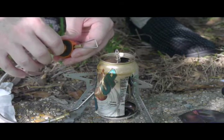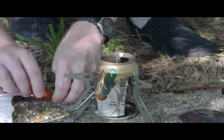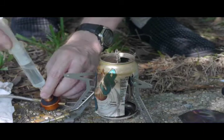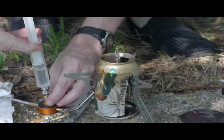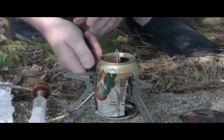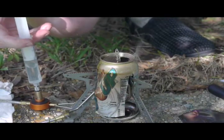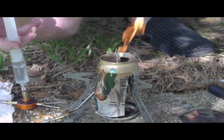You apply a light amount of force against it to seal against the O-ring, with the control valve open all the way. You just screw the syringe on — doesn't have to be very tight. I'll put in a little bit of fuel just to prime the line; this isn't meant to fully prime it, just to make sure there's some fuel in the line. Then I'll go ahead and light the alcohol. I may add a little more fuel. Already we've gotten some Coleman fuel in here, which will help improve the starting characteristics.